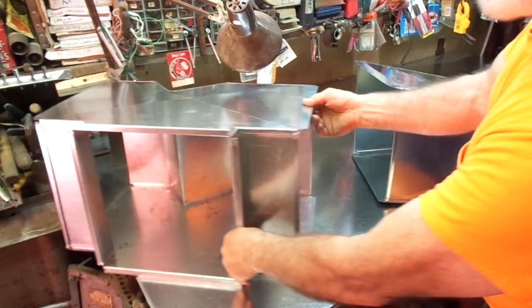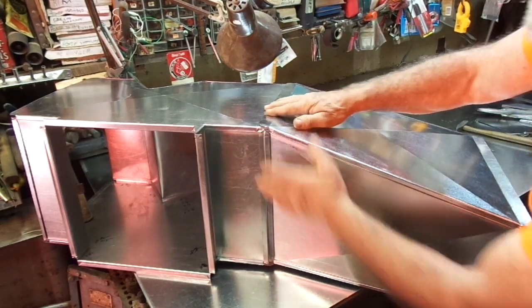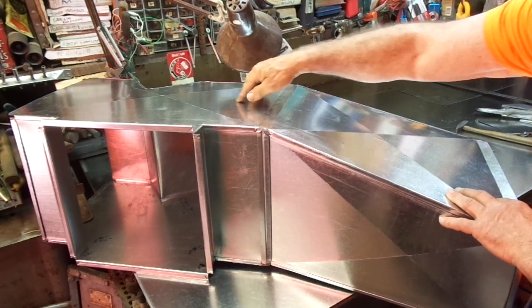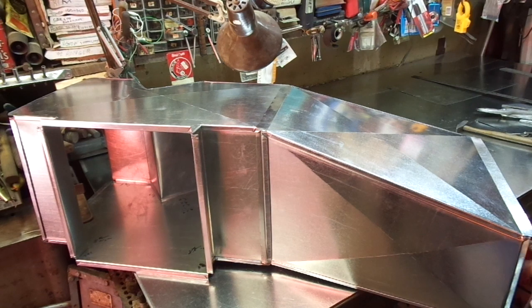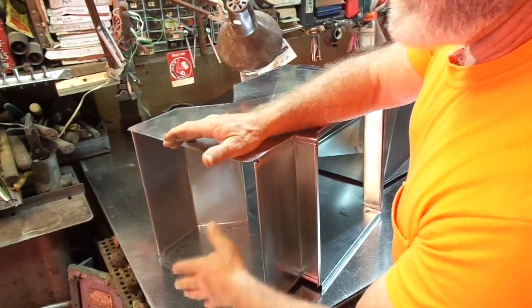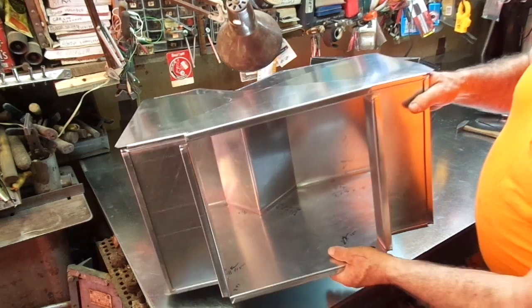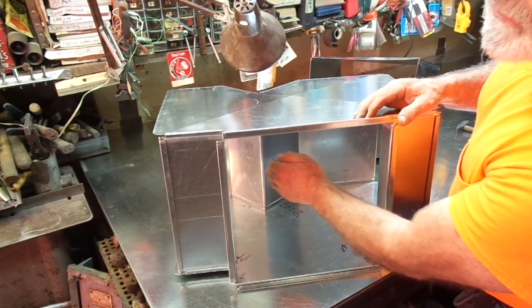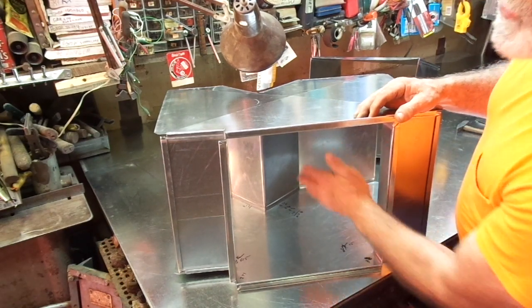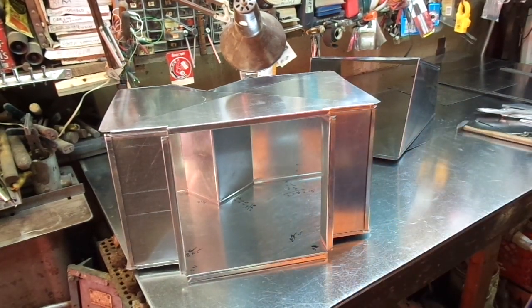To make a long story short, if this thing is laying down horizontally, we come in here like this. This gets an S joint and this is a drive joint, but you can see how that's going to attach right there. We've succeeded in bringing that air into here and we're going to pinch it down to the dimension required to move the cubic feet of air per minute going to the large trunk line. The next step is to do the same thing but pinch it down to a smaller dimension, because we require much less air to that end of the hall. On a commercial or higher capacity residential job, we would also put turning vanes inside here — just a series of little corners that knife into the airflow and allow it to go around the corner much quicker. But this is just a small two-ton system, 800 CFM total, so that's not going to be required.